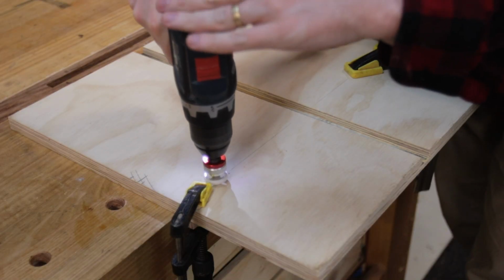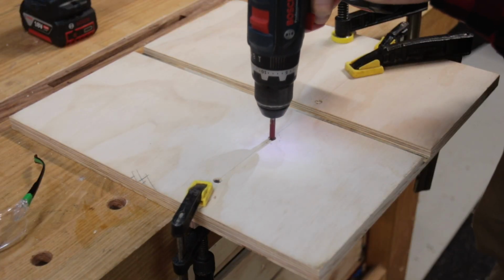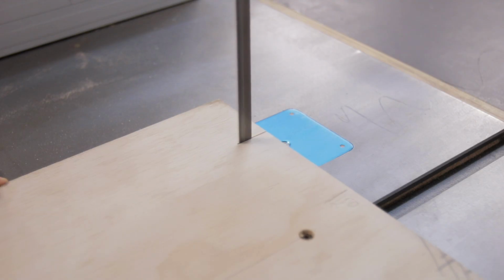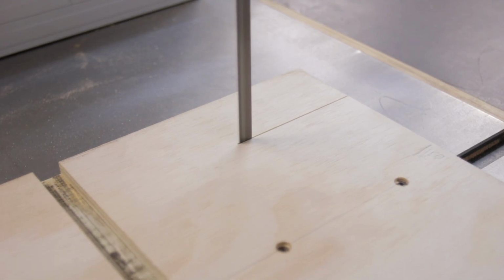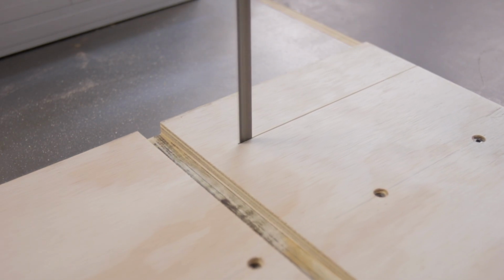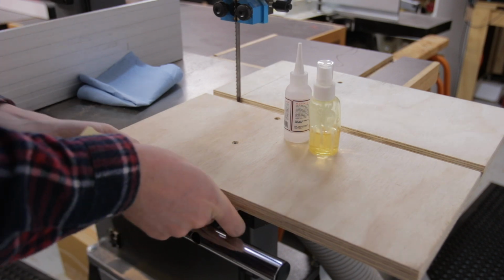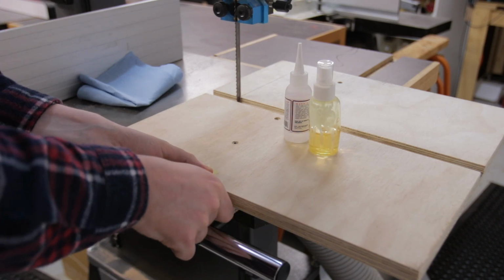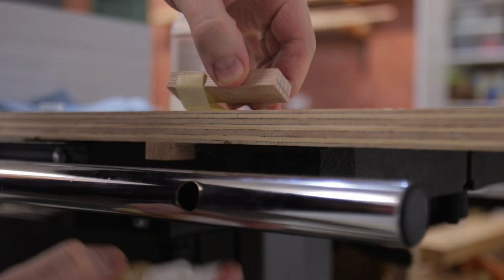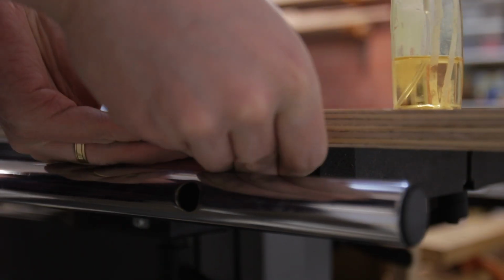While the glue is still wet, I countersunk and screwed in screws to act as clamps. Once the glue is dried, it's time to add the saw kerf. Normally this sled is smoother, but I hadn't scraped all the glue from the runner properly. Saw about halfway through the dado. With the saw stopped, a small spacer can be glued on with super glue to act as a hard stop for the sled. This stop will bump into the bandsaw table and prevent pushing the sled further forward, which would mess up the alignment of the pivot pin. I used just an offcut of the miter runner.